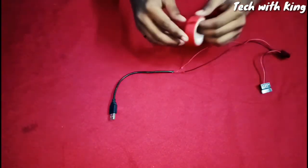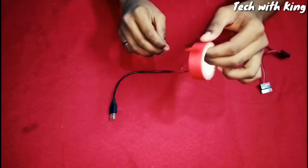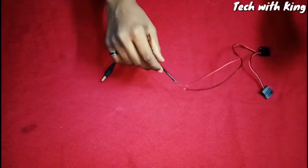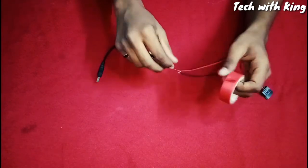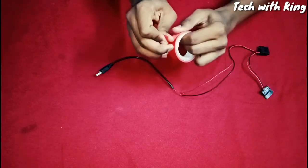You have to make sure that you tape the wires. I am using electrical tape. After attaching the wires, you need electrical tape because if plus and minus touch each other, this can break your hard disk. So make sure you have attached the tape properly.